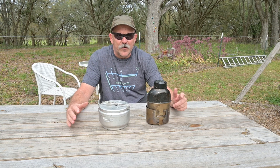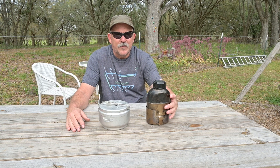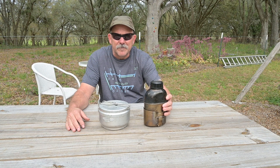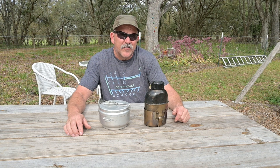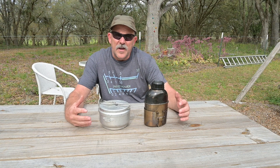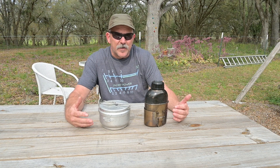The equipment itself is not subject to maintenance requirements if one empties the boiling vessel before all of the untreated water is boiled away. The disadvantages are that it is an energy and time intensive process, and something small enough to be man-portable limits efficiency further — so much so that its use for survival purposes is questionable. This is more of a 'can I do it' build for myself than a survival tool.